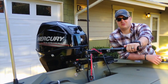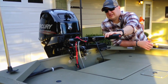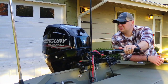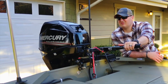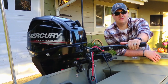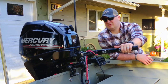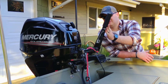If you're having issues unlocking the motor, it's probably your throttle position. There's also a kill switch on the front of the tiller — a red button. You're just driving along, push the button, and it cuts off — no choking or anything, very simple. Bass Pro told me this is one of the best motors to put on duck boats — super reliable, very low maintenance, they run great and start every time. With 25 horsepower and two full-size adults, we can get between 20 to 30 miles per hour depending on what's in the boat.